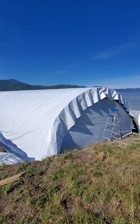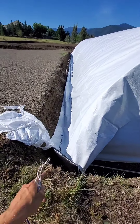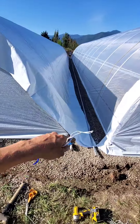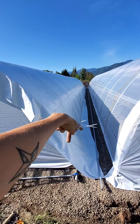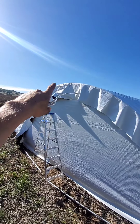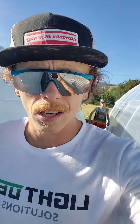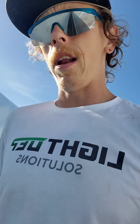We have one greenhouse covered, 24 by 100. You want to make sure you have slack on both sides. I've got this side tacked where I like it — I'm going to go to the other side and pull it over. Tack your top center so that this doesn't flap up and away from you. We're fortunate enough to be pulling early AM in Ashland with zero wind — maybe a one to two mile-per-hour gust. If you're a greenhouse builder, you definitely learn how to read the wind. Never pull tarp in a blow.